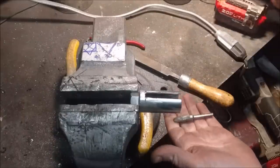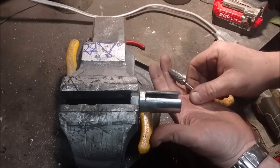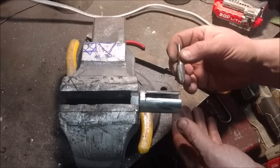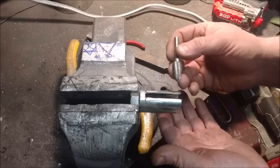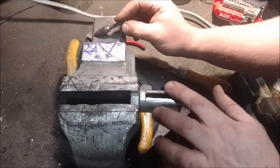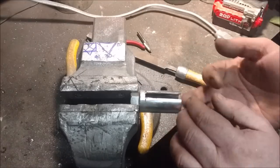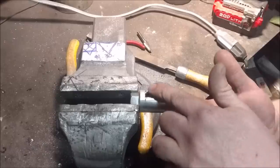If you've never used one of these carbide burrs, they're amazing. I bought a whole set of them a couple years ago and it's been really worth the money. It's like a file where the file can't get — these do — and they'll remove material. You can oblong holes. If you drill a hole you want to oblong, these do it. They get in the tightest areas, come in a bunch of different sizes. I'll put a link below in the description for the ones I've got. This is nice and smooth now because I don't want it to actually rip the belt — I don't want any sharp edges.